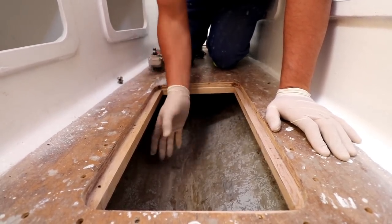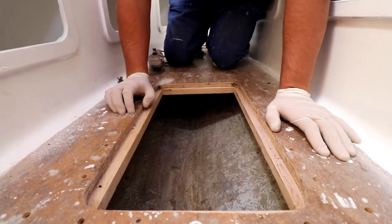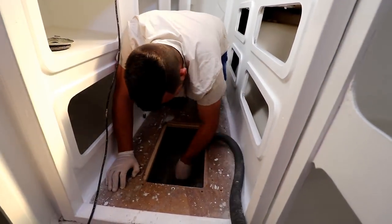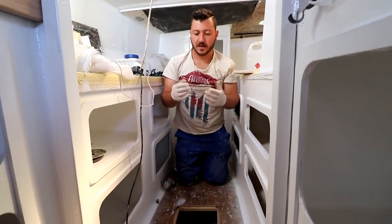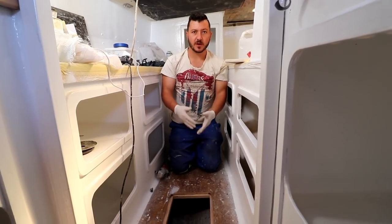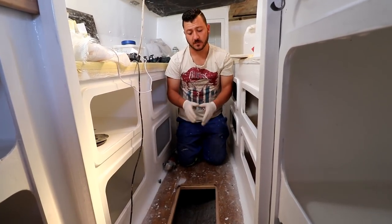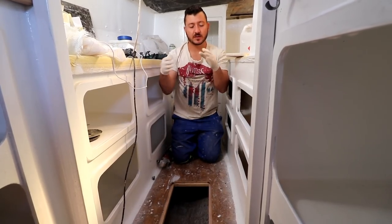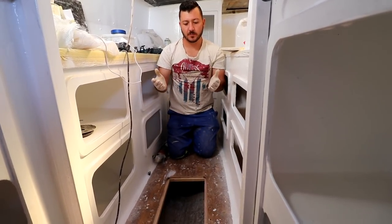At this stage we're going to vacuum, then do an acetone clean — you could do a soap clean before that as well. All the prep just benefits the final result. The reason I wear gloves is that your body naturally releases oils, and you don't want to touch the surface you've already prepped. That oil transfers to the surface, and although flow coat and pool coat are really tough and create surface tension across their entire length — unlike general paint where one piece will peel off — better prep always means a better end product.